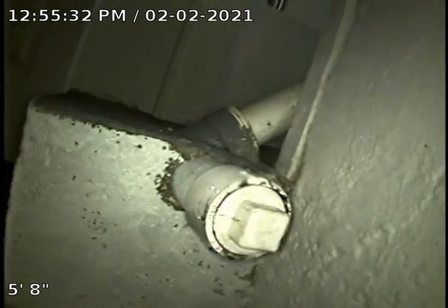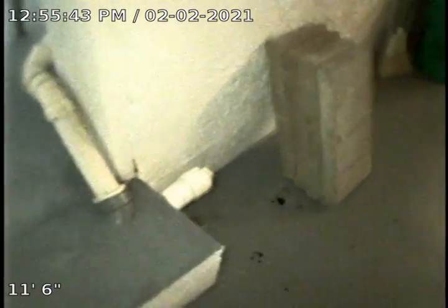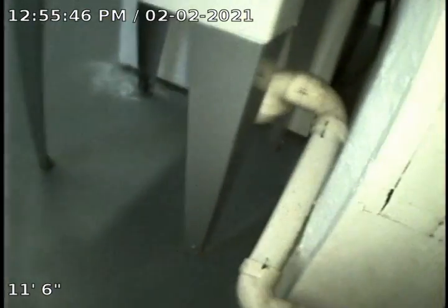I also went over here to this laundry clean out area. Get the camera off there. And this was plugged up, just a couple of feet inside here. There's a lot of lint built up in here. It comes in here to this bathroom drain, but you can see this arm comes down from the laundry tub. So there's a lot of lint buildup in this line here. So this is going to need to be snaked and cleaned out.